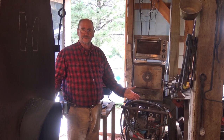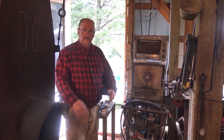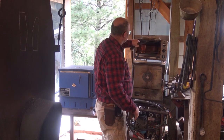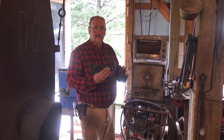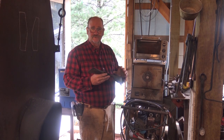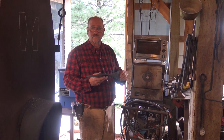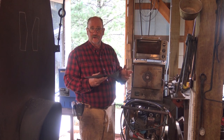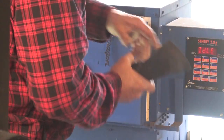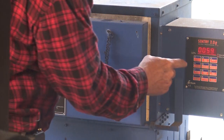Welcome back — it's the next day, another nice cool morning here in Beulah. Still hard to believe that it's August and I'm wearing a flannel shirt, but we had it up to 90 degrees in the shop yesterday so it'll warm up fast. Our Pulaski project sat in the toaster oven for an hour and I just let it cool off with the toaster oven. I want to temper it a little bit more — I want to make it just a little tougher, which means slightly less hard. It'll be easier to sharpen in the field with a file. To do that I want to heat it to 500 degrees for another hour. This says it's actually 59 degrees in here today, so I've got this set to come up to 500 degrees and hold for one hour, and that should do just what I want it to do.